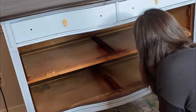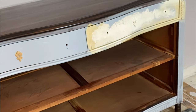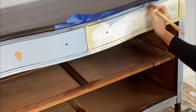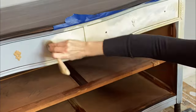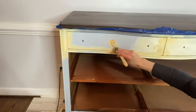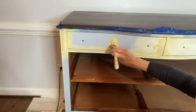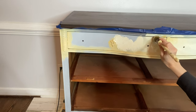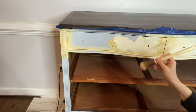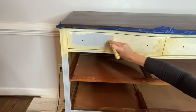Finally, three days later, I am ready for paint! Wouldn't it be great if we could just jump in and start painting right away? I find these pieces on the side of the road sometimes, so I always have a lot of prep work before I begin to paint. Today's project is going to be all about Terra. Terra is my favorite paint to use for texture. Since this piece is a little beat up, putting this paint down is going to give me a textured surface. When you pounce the paint on in this manner, it keeps those little peaks and valleys in your paint, giving you texture where there was none before — perfect for hiding any damages. The colors I'm using here are Prairie Dawn and Wheat to get a yellowy base coat, and once that first coat is dry I'll move into Marigold and Bougainvillea as well.